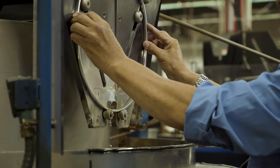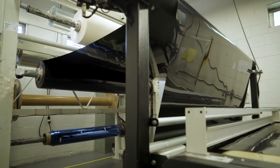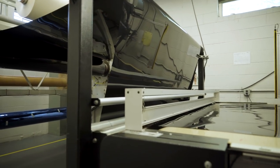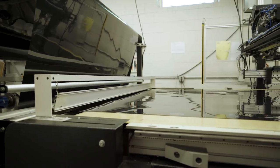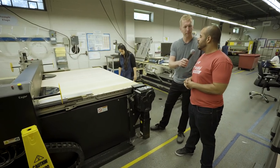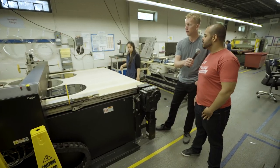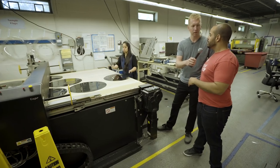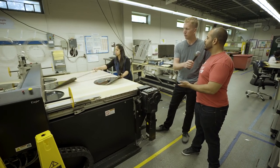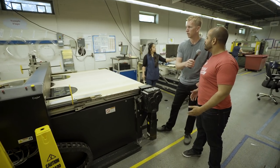A small amount of flux solder is applied to close the hoop. After that, it's the film cutting. All kinds of material go through the same process. Here we'll cut films into a whole bunch of different diameters for different size heads. Right now it looks like we're cutting some maybe 18 or 20 inch bass heads. They'll all get cut by a blade, and then the operator will pick them off the line and load them onto the scales that help keep track of all the quantities of the product.